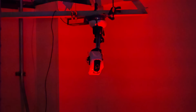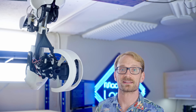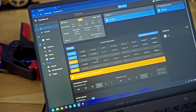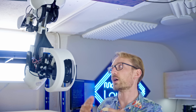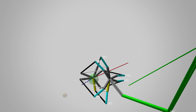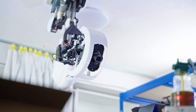Which I unnecessarily did completely from scratch. Up until this point, all the movement had only been to save the position of each of the actuators, then play back a list of those positions and smoothly interpolate between them — keyframe animation, basically. To save a new keyframe, I can set these servos in the head to output zero torque and then move them into position by hand, and for the base axes I jog those into position. Now with IK, I can tell it to move the head to any specific position in space while also facing the Stewart platform towards a specific point in space. I can leave that focus point fixed and only change the head position to get a perfectly tracked slider move, or if I just change the focus point, it's a basic tripod-style pan and tilt with the servos doing all the work.